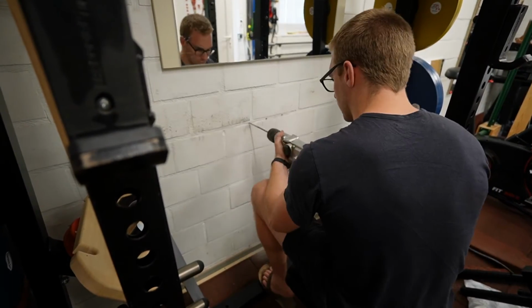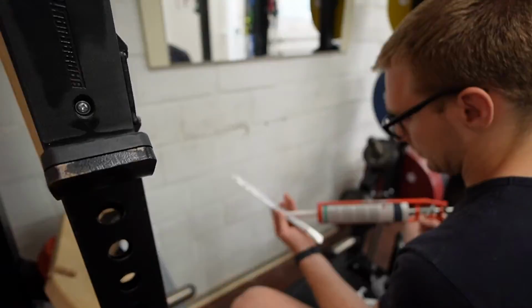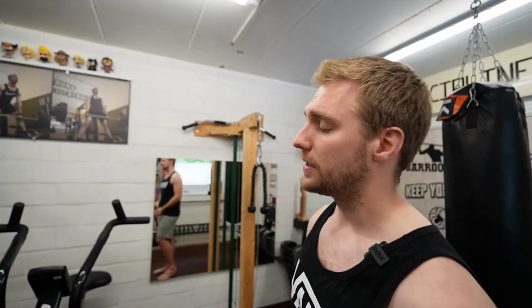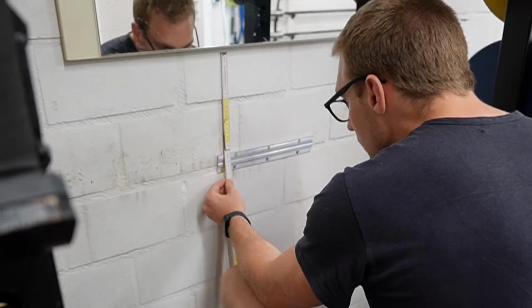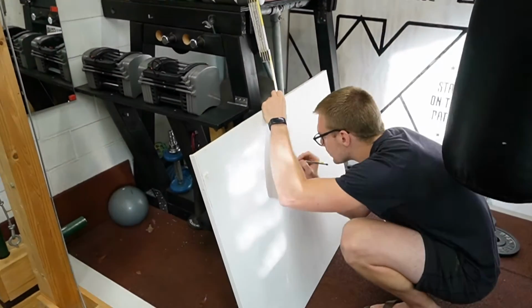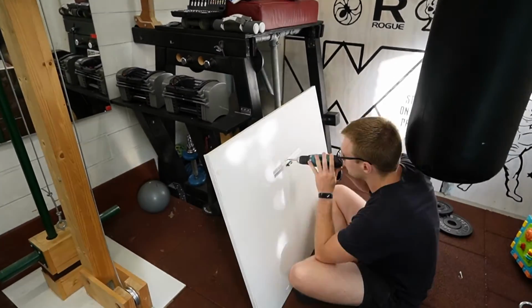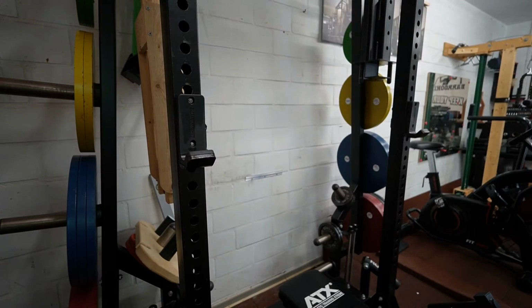The best way of measuring it is you hang up your first one, like you eyeball which is approximately a good height. Then you put in the other part of your French cleat, so without the mirror, and then you measure from the top to where you want the mirror to come, and that is your measurement that you're going to use on the back of the mirror. And from there you're going to place the French cleat system, make sure it's level, and then screw in 3 holes and you're done. All you have to do is take up the mirror and hang it up.